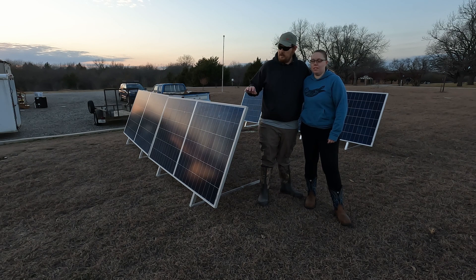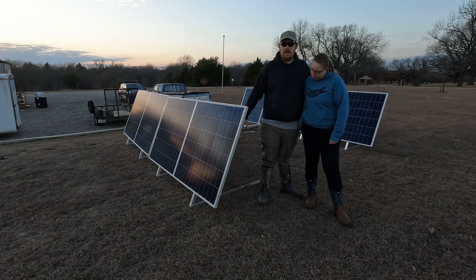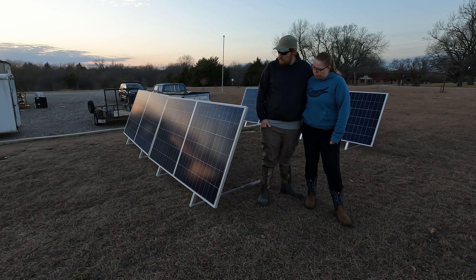We finished our portable solar panel array. These are four 390-watt bifacial panels that we bought from Santan Solar. We fabricated the aluminum brackets and stands ourselves to make sure we have the appropriate angles for Montana sun — it's like 66 degrees in the winter and about 22-23 degrees in the summer. We'll probably adjust for spring and fall too, which is around 44.5 degrees. Overall, we're quite pleased with how it all worked out. I'm looking forward to plugging in the EcoFlow and getting things further tested. Any comments? As long as it runs my TV.